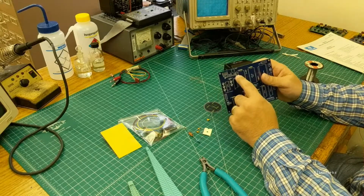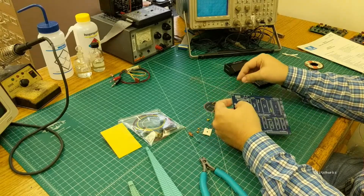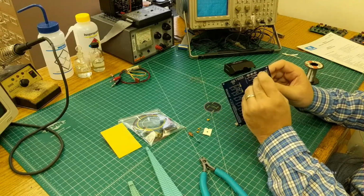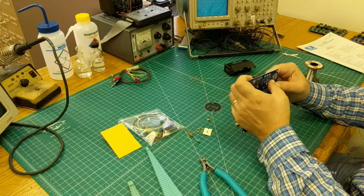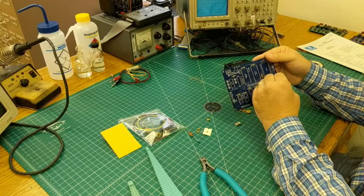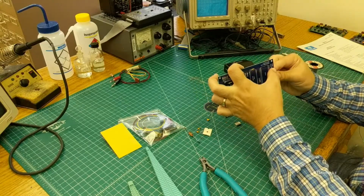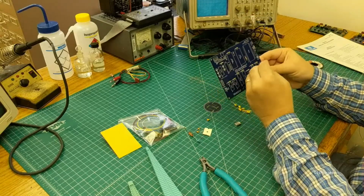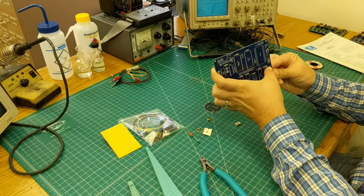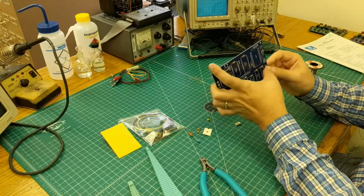And all of those are done as hairpin resistors, so that they are distinctly different, to sort of make that obvious for which ones you need to install, which ones you don't. And they're, again, no polarity, so you can put them in either way. 2 down, 1 up here. So there should be 4 of these total if you're using an R65X1Q. There will be 8 total if you're using an R6511Q.